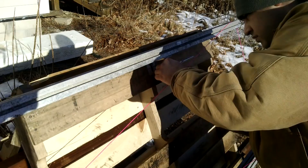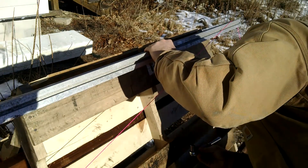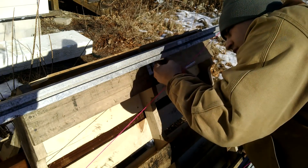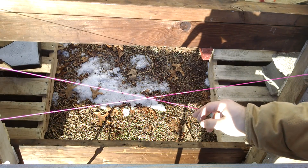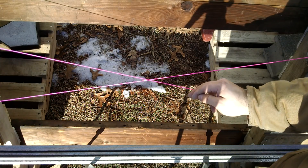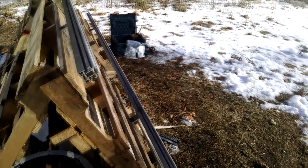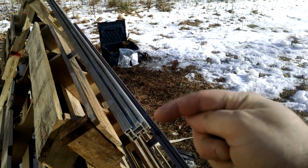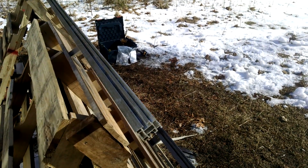So I'm going to make some adjustments. I'm loosening this guy up, and then I'm going to pull them out one click, and tighten them back down. Now you see how we're getting better? So this is where I'm going to leave it. I'm going to tighten down all the bolts now — it's almost perfect. Now they should be in plane with each other, and we can sight down it and see how they disappear. So this one disappears at the same time as that end. It shows us that they're in plane with each other.